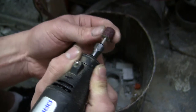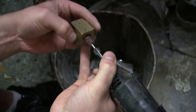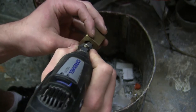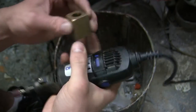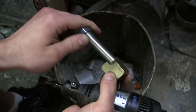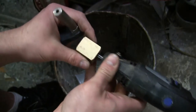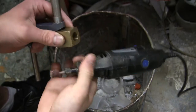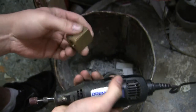The medium grit can possibly be used, but for this I'm using the coarse version. To open up the tolerances, I'm simply going to use my hands to hold the component as well as the tool, and carefully remove just enough material for the piece to fit so it can rotate nice and freely, but not too much where it will have any wiggle. It's a good idea to have your sample swing arm in hand to test fit the component. After one or two of these blocks, you'll begin to get the muscle memory to do this on the fly. I'll be doing this block in real time so you can get an idea of the actual procedure.